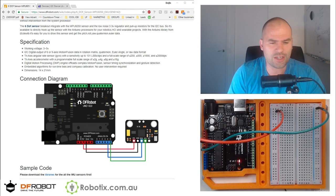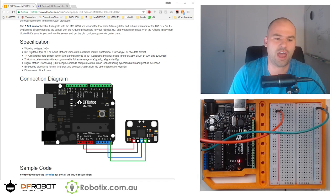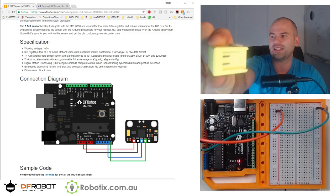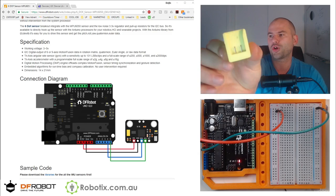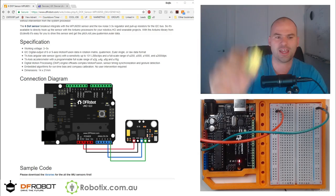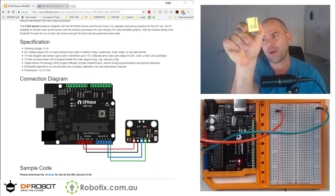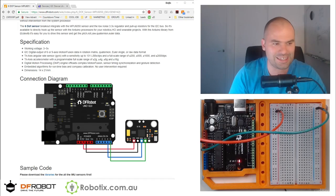So essentially an accelerometer, if you placed it still, would be able to detect gravity and the absence of gravity for once. So the idea is I'm going to place this gyro accelerometer on this cube, and we're going to turn it at different angles, and we're going to see this actually in effect. You're going to see how gravity is distributed if this is tilted and how it's distributed if it's still.